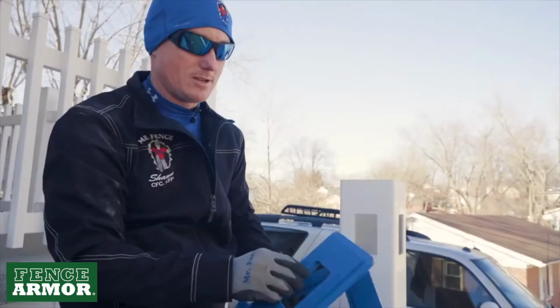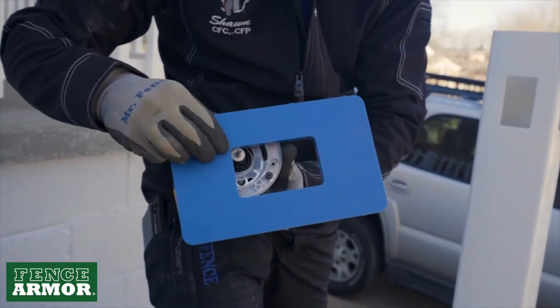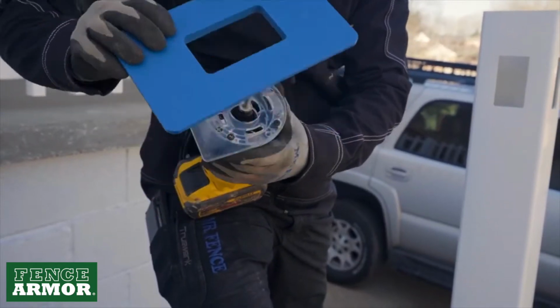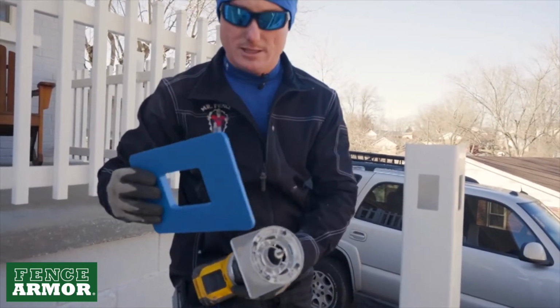It's supposed to be bigger than the hole because it's for the router bit collar. So the cutting edge of the router bit is that same distance in. So this is oversized so that the collar rides on this and it cuts a hole smaller, that size. That way the router bit won't damage the template insert. That's why it's done that way.